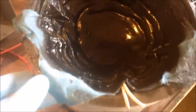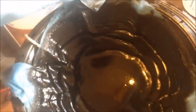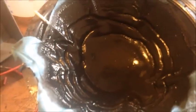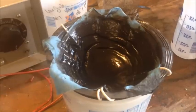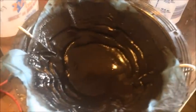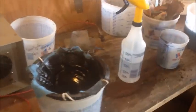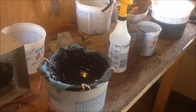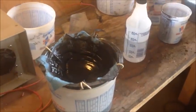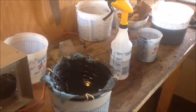It's been a couple hours and our material has drained through the filter — you can see all the black sludge left over clinging to the filter paper. Over the next couple of days I'll get this dried out, peel it off the filter paper, and make another video where we smelt this down with some oxidizing flux to get our precious metals out. Thanks for watching this segment of our smelting and refining series — I'll post a link to the anode slimes smelting video when it's available.